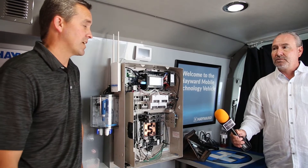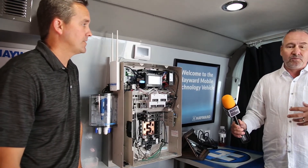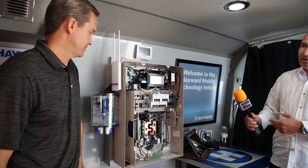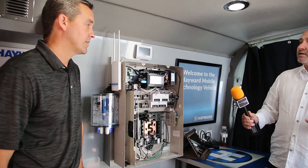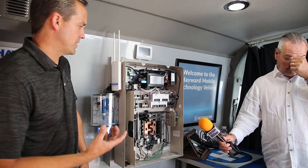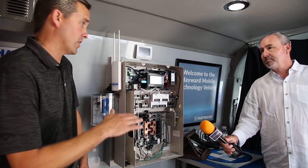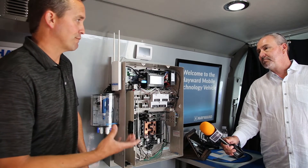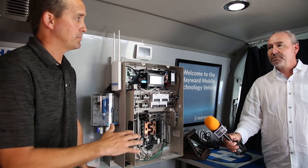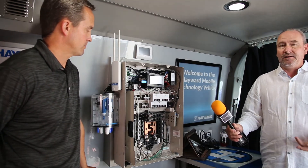This is one of the reasons we wanted to have you here — to explain all these new products that came out right after the pandemic: the new heater, the new OmniLogic version, and the new salt cell. The T-Cell 340S is a salt cell optimized to operate at 1,200 ppm salinity. You don't need 3,200 or 3,400 ppm anymore. You may not get the full 1.48 pounds of chlorine production per day at 1,200 ppm, but you can lower the salinity and reduce chlorine output — which helps the homeowner and protects materials.